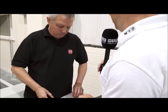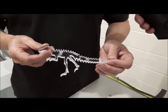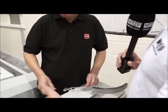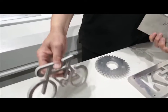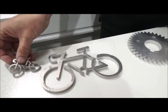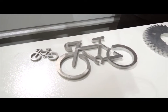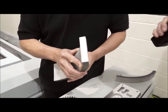And then there's a component here you certainly couldn't do on an oxy fuel machine — you'd struggle to get that on a plasma machine either. It's just a little piece of perspex that we did as a sample. And we've got a bike here as well — a nice little demo piece. We can go from small bicycles all the way through to large ones; it's the flexibility of the process. This is a nice piece of expensive high-grade material, and that's as it comes off the machine. To machine that out of a block or billet would be far more expensive, and if we needed two of those, we could nest them together in the software.